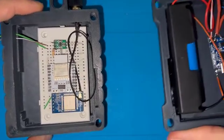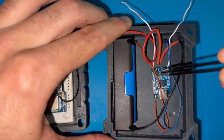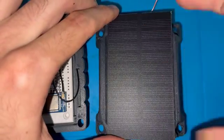The other side of the case will hold the battery — here's the 18650 battery I'm using — along with a battery charging circuit. At the back of the case I have a solar panel so I can charge the battery when the device is placed in sunlight. What I need to do is hook up the output of the charging circuit to the buck converter in order to power the system.